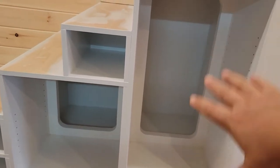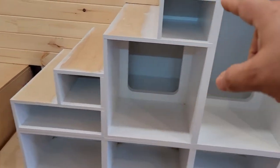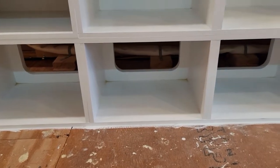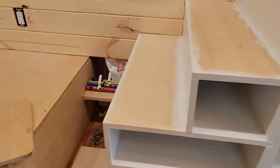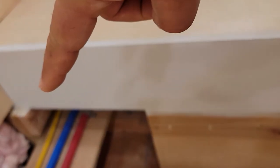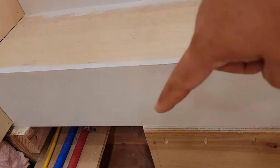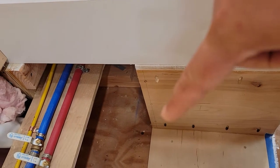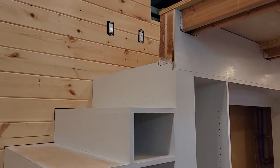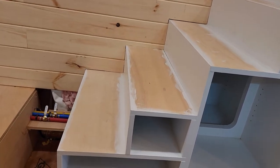So: shelves in the front, shelves in the back, faux panel in the center. That concept follows through the large and medium cabinets, and the smaller ones just have dividers going through them halfway for knickknacks. Down here, same thing — our utility trough is back there. Following the same support pattern as the stairs, you can see back here we have a stronger support for the edge of the staircase, with that rib running from the floor all the way up through the first cabinet and continuing through the staircase. Basically, wherever a person is walking, they'll be stepping on a support that runs from their foot to the flooring.